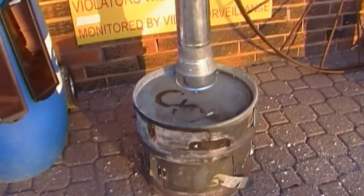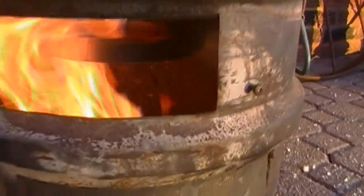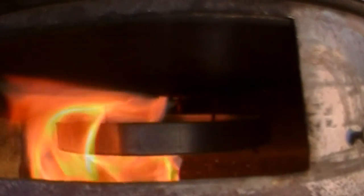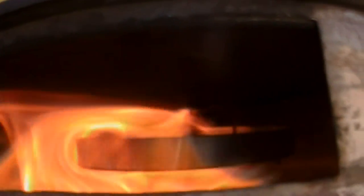It's not quite heated up yet, but I wanted to check something out and share it with you. I opened the top door I made here, and I wanted to see how the baffle that I made is interacting inside there and how it works. So you can see what the baffle does — it makes the flame travel around it before going up the chimney. I think what it does ultimately is add more heat to the top of the stove to maximize it as a cooking surface.